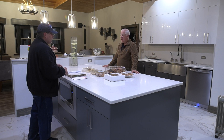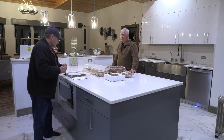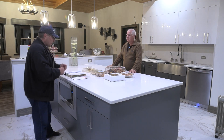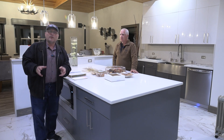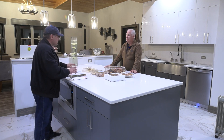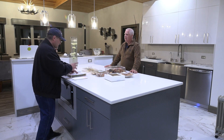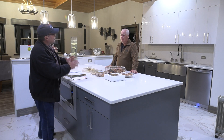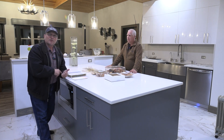Remember when we did the 2017 code? It was completely different. Now they changed it — it's a really significant change and you got to read this very well. So for the first nine square feet, we got to have a receptacle outlet. And when we measured this, it's approximately 34 square feet. So when we take 34 square feet minus nine square feet, we have 25 square feet left over. So what do you do now with this 25 square feet? A receptacle outlet shall be provided for every additional 18 square feet or fraction thereof.